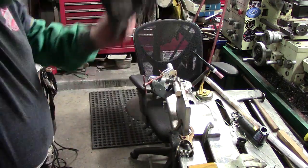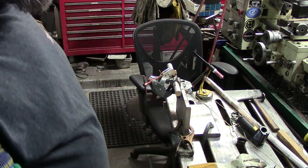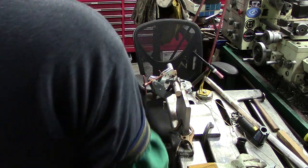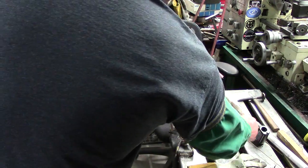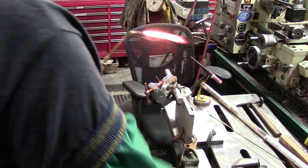We'll go ahead and get everything ready here. I've already got the TIG welder set up. We're going to be running at 200 amps because this is thick. We're going to preheat. I figured I'd just go ahead and have it, that way I can throttle back. And let's get started. I'm just going to start going at it here. Got gas going. I'm going to heat this puppy up and get going.